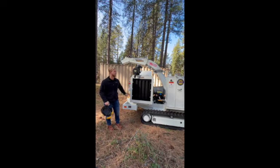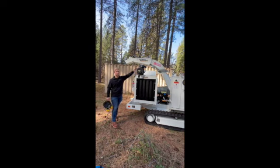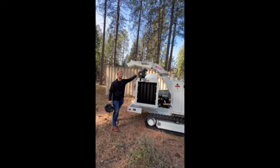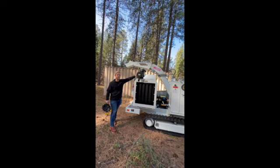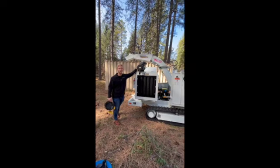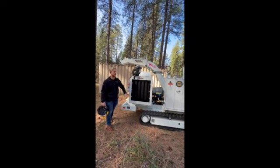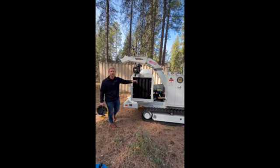You can take them and tap them lightly. You do have a pressure indicator on this as well. When this air filter is clogged and needs to be replaced, this little spring here is going to pop down. You're going to see a red piece of plastic come up. That's telling you this air filter can't breathe and needs to be replaced. So in that scenario, just replace both air filters. As you guys know, a spoonful of dirt in this engine, you just bought yourself a new engine.